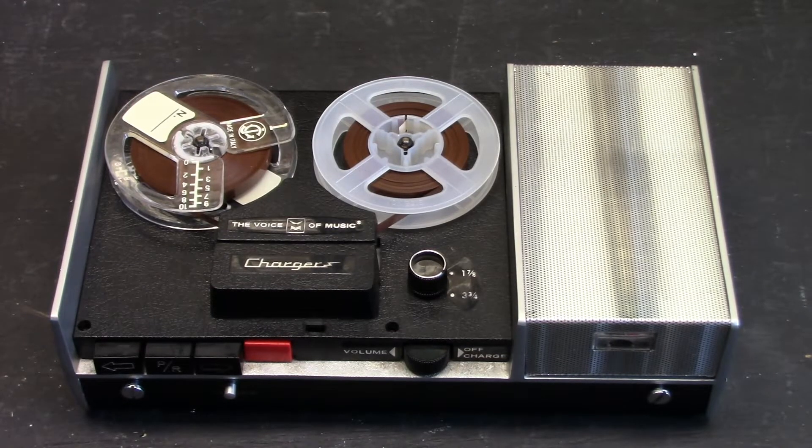The basic charging circuit of just a series resistor to limit current — commonly used to recharge NiCAD batteries — is not acceptable to use with a lithium-ion battery. Lithium-ion batteries are very dangerous and must be treated carefully: not overcharged and not short-circuited.